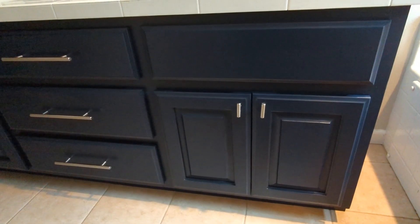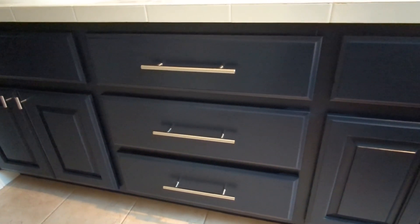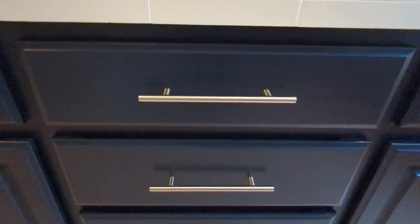For the cabinet door, I did the flat part and then went into the bevel, but not the outside frame — it was easiest to just extend that into those little crevices. Make sure to go back and check the little inside edges and corners to wipe away anywhere it's dripped or pooling, and that will keep a nice clear finish as it dries. And the next day, this is how everything looks — everything matches. There's no difference between the surfaces I patched or recoated and the ones that were original, which is a win.